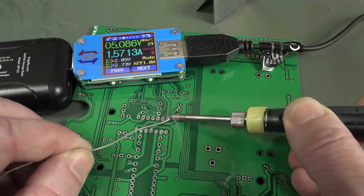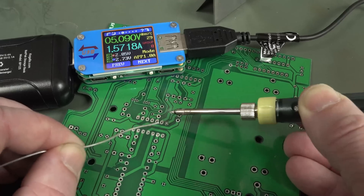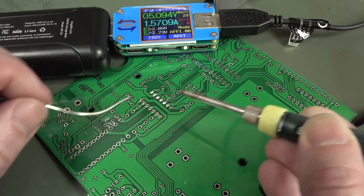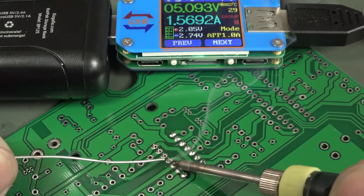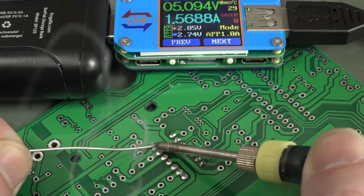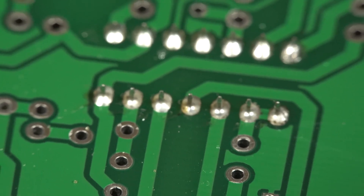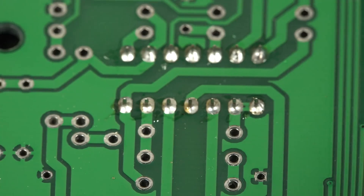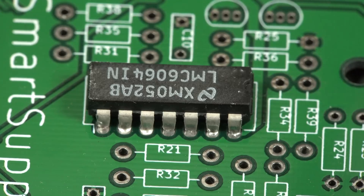Here we go. The problem is the flux burns up before you even get the iron on there. It does the job. Let's try that again. There we go — it's not too bad. It's doing the business. You can go from joint to joint — it's alright. You'd expect it for such a high temperature. That actually produced quite a reasonable result. I quite like that. Just don't go doing much rework with this, because it could easily lift the pads — the temperature's just so high. And it even did a decent job flowing through to the other side as well.